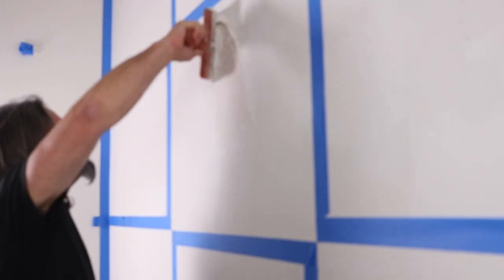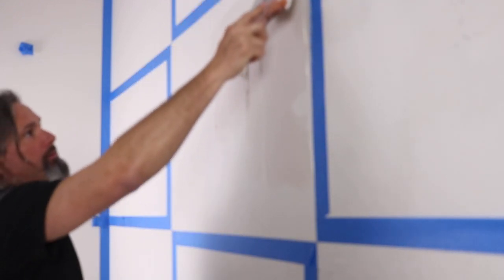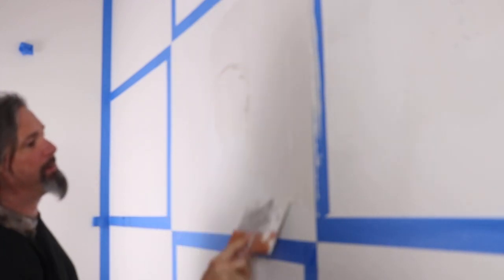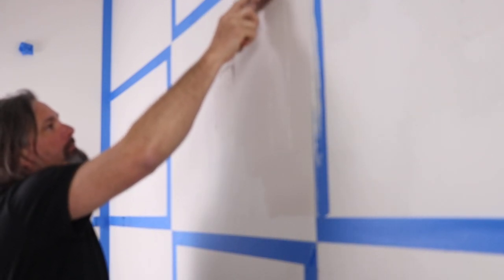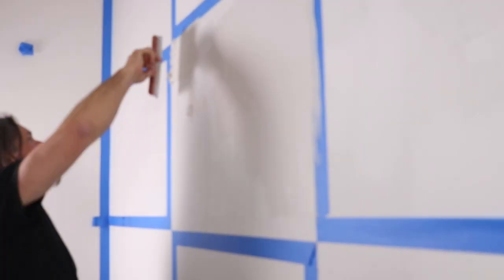So I'm going to take my big blade and the old-fashioned joint compound. Good thing the floors are covered, huh? I gotta cover the surface 100%. I need it to be even and uniform. Because if we don't have a nice even amount on this surface, we run that blade, the roller through there, it won't be. We won't have a nice even texture. Should be using my pan.